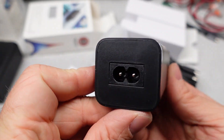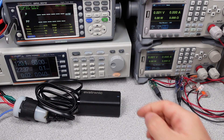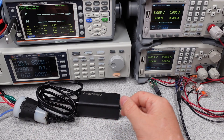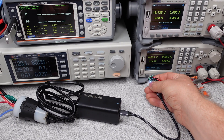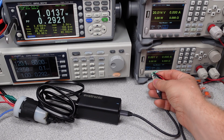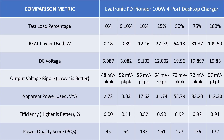Let's plug it in and find out what it can do. The first thing I see is it has reasonably low idle power consumption — no alarms and no surprises. For modes of operation, the adapter has 5, 9, 12, 15, and 20 volt fixed USB 3.1 power delivery modes on the USB-C port. The power adapter also has the programmable power supply mode at 21 volts and can go up to 5 amps, so full power. Power negotiation is typical with any plug and unplug requiring a reset of the USB modes of operation. The AC data is very similar to the Rosarin; however, it is less efficient — enough to make a difference in the performance figures. When you're at the top of the stack, a little bit counts.